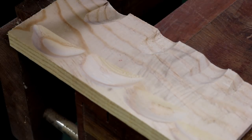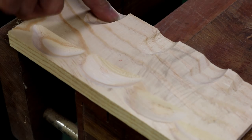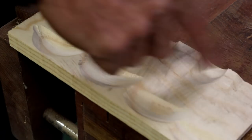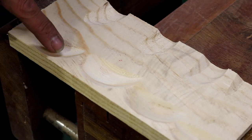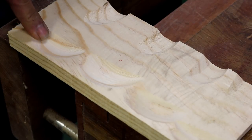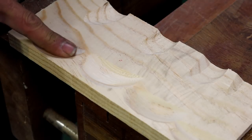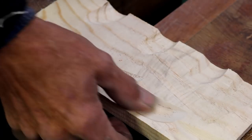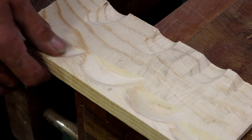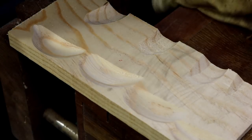At high speed, the tear-out here is somewhere between the two cross-grain cuts with the Graff. The with-grain high-speed cut is almost smooth enough that you don't have to sand — really smooth, actually even smoother than the Graff at high speed. So there's that comparison in a softwood.